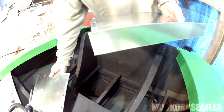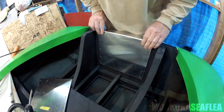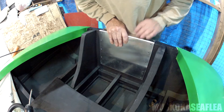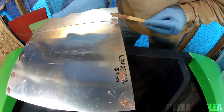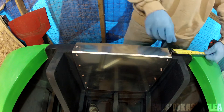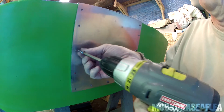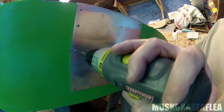I'm going to go outside and show you how I'm going to assemble that. Here we are — I have the two plates. I've drilled some holes in them to put the stainless steel screws in. This is going to sit just like this, and then my back plate will go behind here. Before I put the screws through, I'm going to mix up some thickened epoxy just to seal the screw holes.